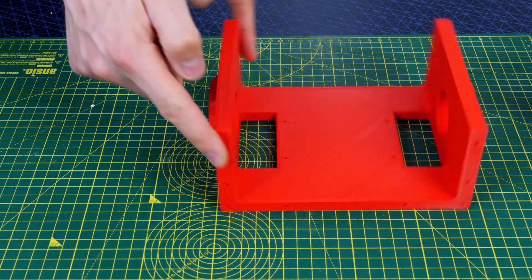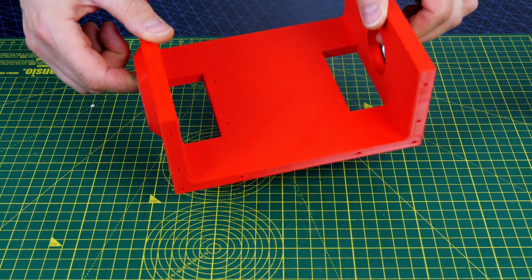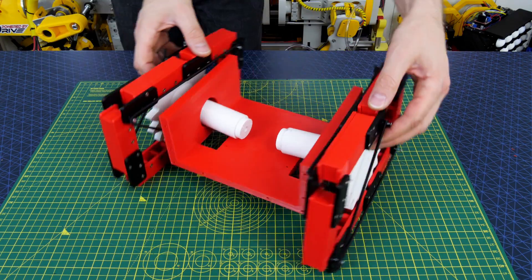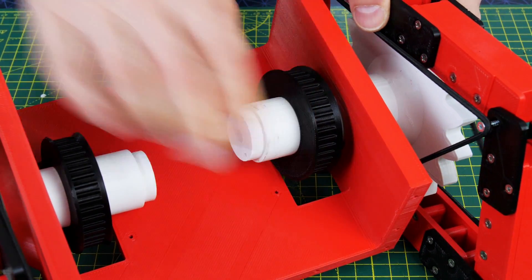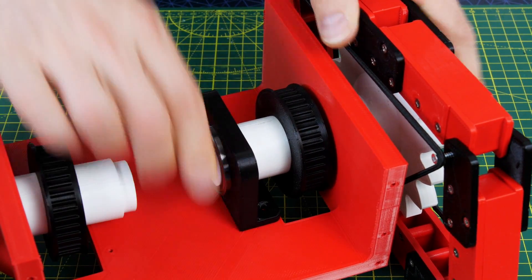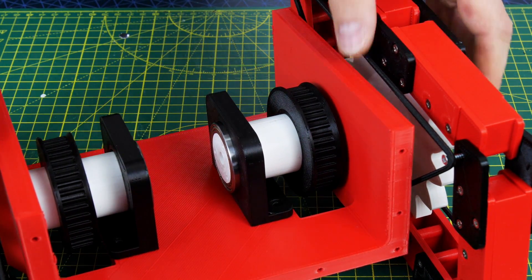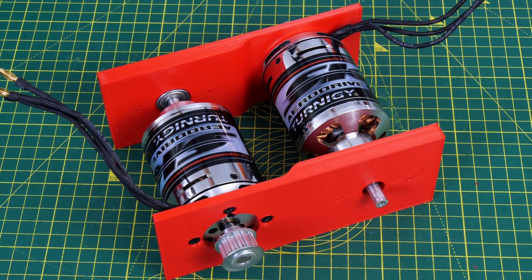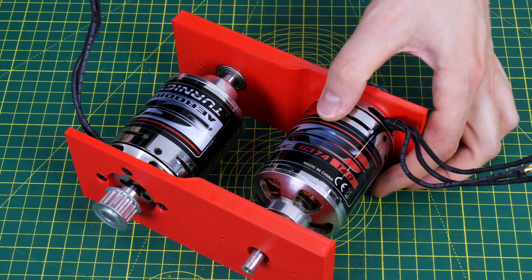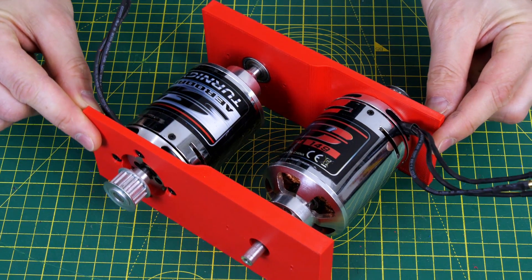The base of the drive unit has two bearings, one inserted in each side for each of the tracks, and also two holes in the bottom to fit the pulleys. I've extended the axles on my sprocket so one fits in each side, and I 3D printed T5 pulleys which fit into those holes in the base and will eventually be glued in place. There's also another bearing and a screw-on cap to support the axles. My motors are incredibly oversized — those are 6374 149kv motors — but it's always good to have lots of torque across the whole velocity range when building a two-wheel balancing robot.